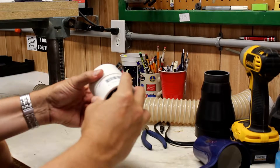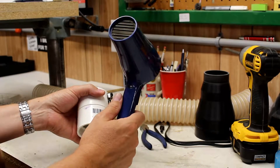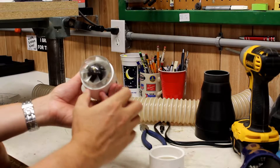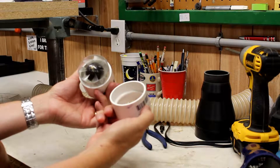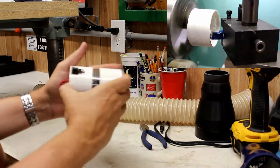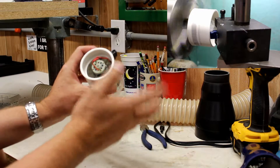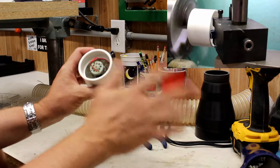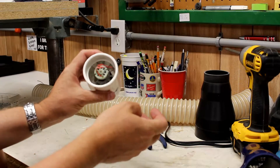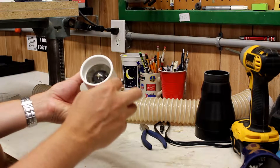Alright, so what I've done is I've taken the Vidal Sassoon 1600 hair dryer — it's a piece of trash because it didn't work very well anyway — and ripped the motor out of it. The motor is actually in a cartridge like this, which is great. It happened to be almost the inside diameter of a piece of 2-inch PVC. So I took two couplings, milled them out so they fit, and put one in this side and one in this side. When you put them together, they go back together and then you put your pipe and you have your motor. I had no idea what voltage it ran on. I first started off with 120 volts, which caused a bunch of sparks to fly, so I'm not doing that again. I just figured it was destroyed, but when I went back to check it, a 9-volt battery worked. So actually I've hooked it up to 12 volts and it actually works great.